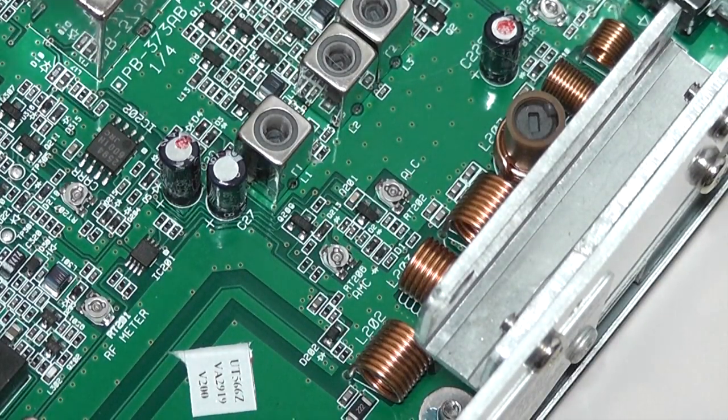The single final on this radio, hitting about 12 watts on AM or sideband is really all you're going to need. If you pair this radio up with an amplifier or something like that, disclaimer, of course, that's illegal as well, but a lot of people do that. If you do match it up, it'll match up well with like an RM KL203, one of those little small ones. It'll match up really nicely. You don't want to try and squeeze every watt out of this thing. It's not a powerhouse. It's not a dual final radio. If you need those, they're available, 10 meter export radios, but for a legal CB radio, this is a great model for that, and just don't expect it to be a powerhouse out of the box.